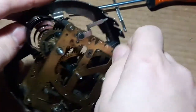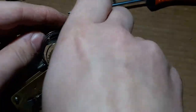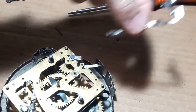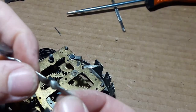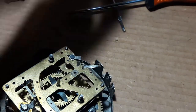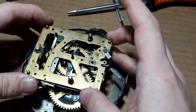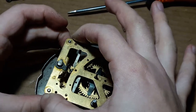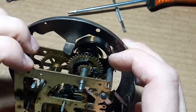I don't have another spring clamp for the alarm, but that's going to be a weaker spring anyway so it should be okay. I'll just remove these nuts. I've also removed the alarm hammer — I just undid the top two and slid that hammer out, because it was soldered together I think, and I didn't want to risk breaking that trying to get that bush off. So I just had to clear the area a little bit. The alarm's already let down — I did that ages ago.